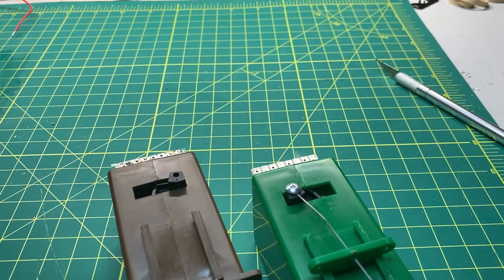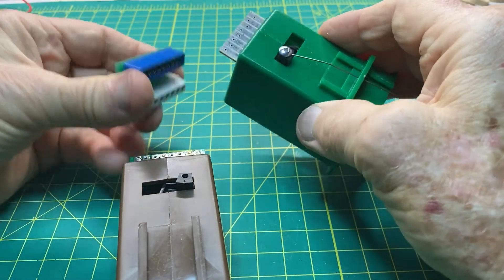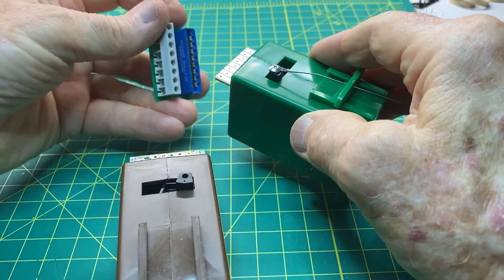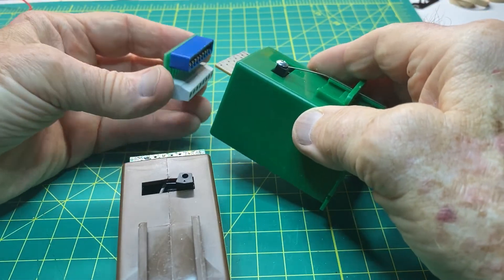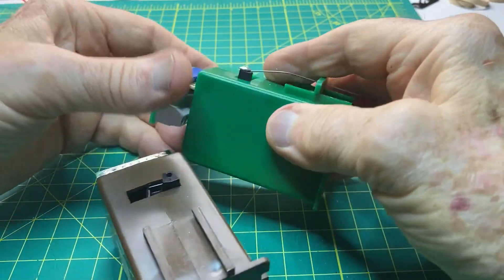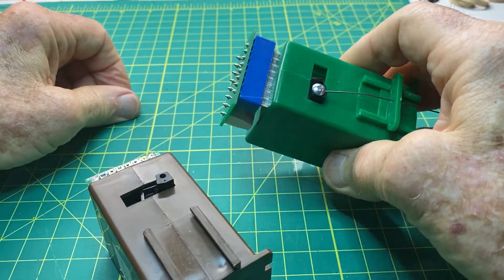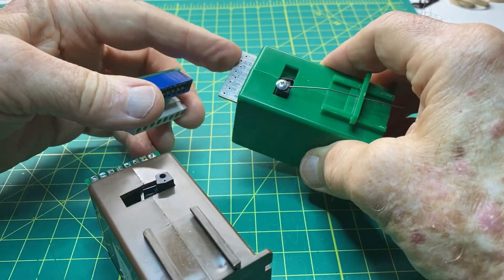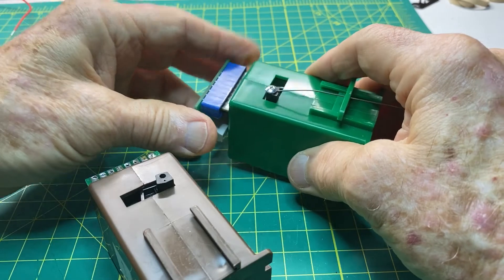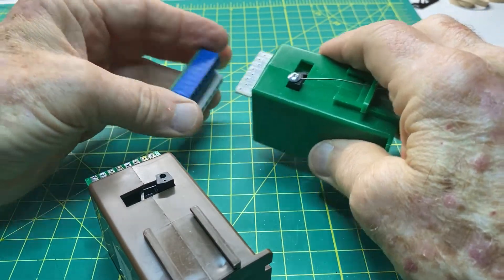When working with these two devices, I strongly urge you to get a separate breakout connector — such as the one from Acolytes for the Tortoise. Acolytes also provides breakout boards for the BDL-168. This slides over the contact board on the Tortoise, allowing you to use screw terminal connections rather than having to solder to each contact. If you want to change something in the future on those SPDT switches, all you have to do is unscrew the wires and rewire as needed.